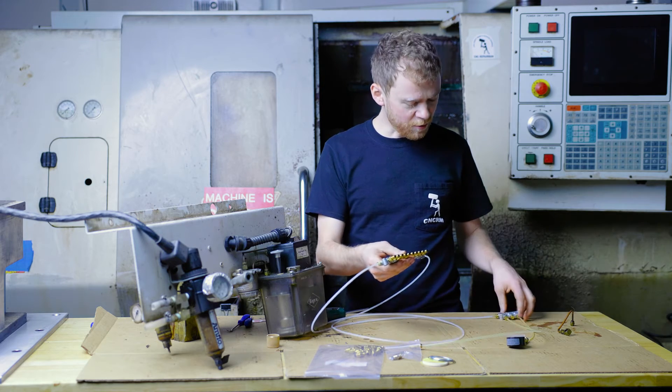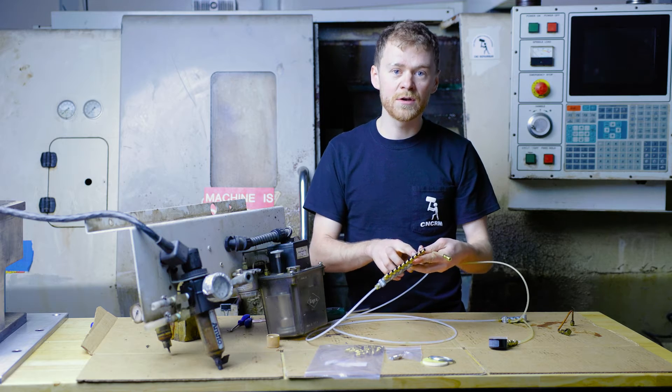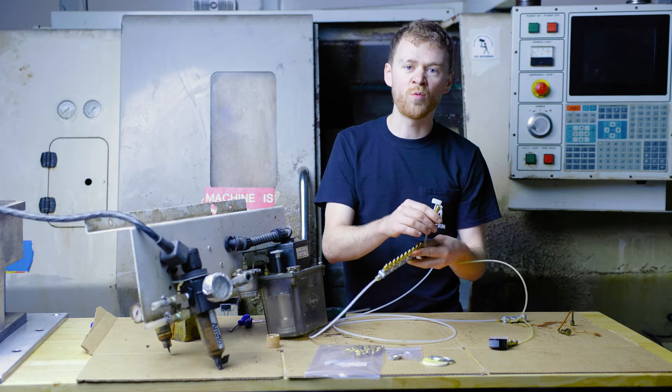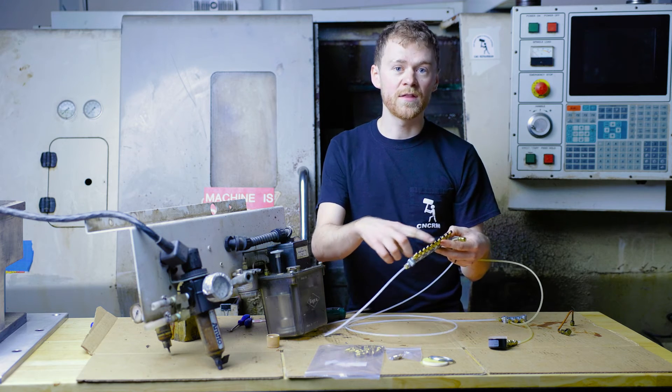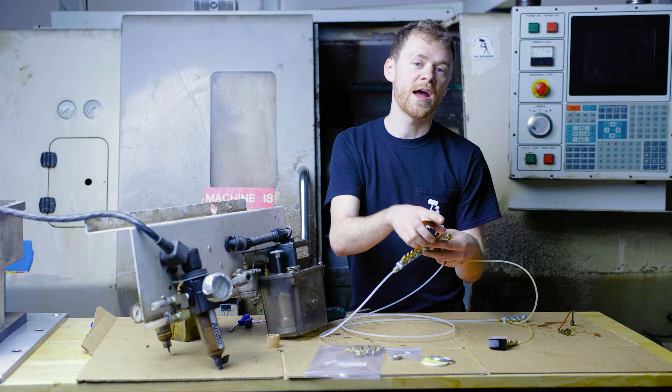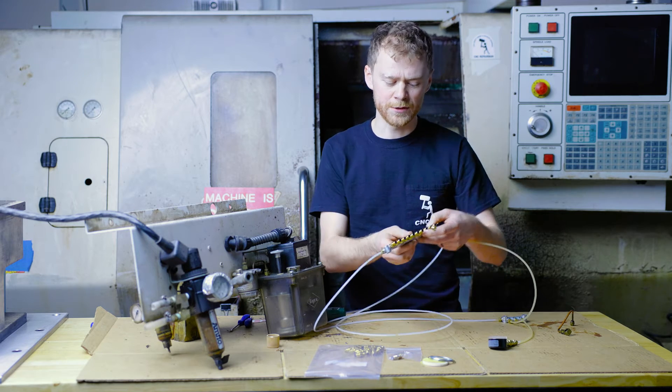This is a little manifold that I built with a pressure gauge, and it includes 10 metering units to represent a lathe, and one for the spindle. I can hook this up to a pump, pump the pump, and make sure I'm getting the equal amount of lube out of everything — out of the spindle — the pressure matches, and I can watch the pressure gauge.